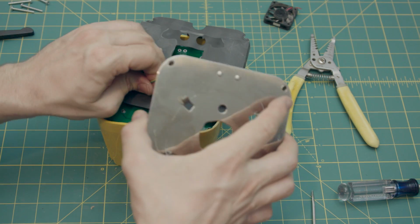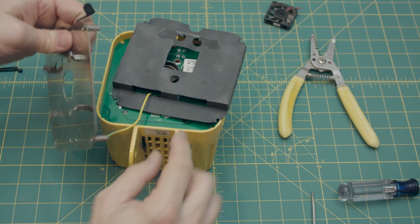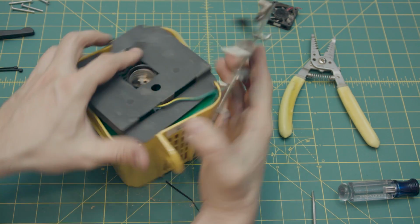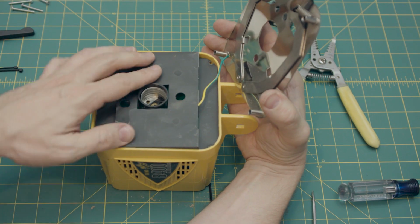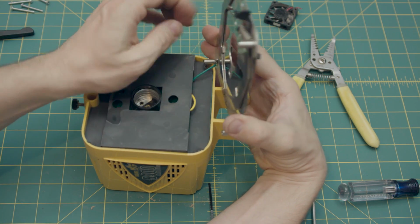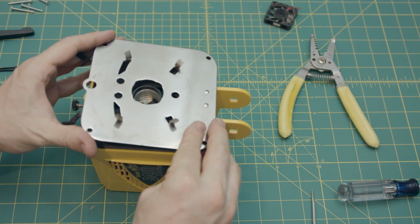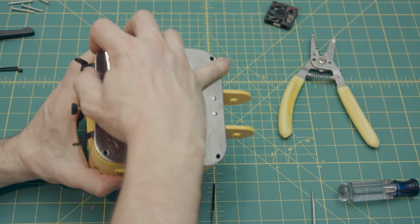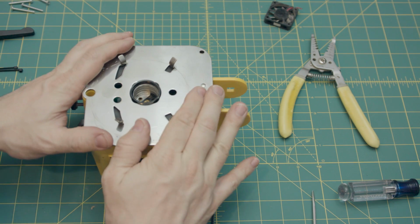You might have to wrap this cable, tuck it, because when you take it apart, you'll notice that this grounding cable is kind of tucked into this second cardboard slot here. So seat that protector, kind of dip that ground cable into that slot there, just because otherwise it might poke out the bottom here, and you don't want that. And then it's a little fidgety to get this plate back in because it sits really snug into this housing. Get that in there nice and firm.